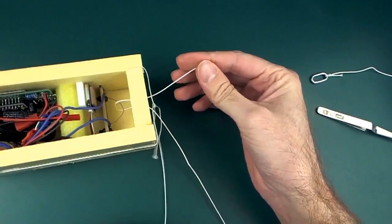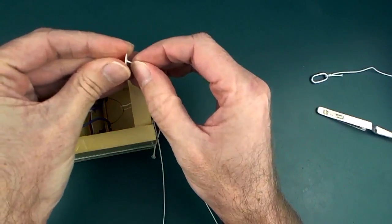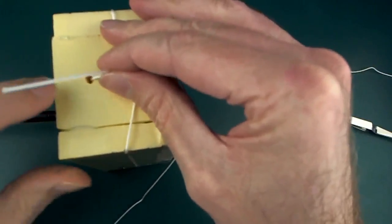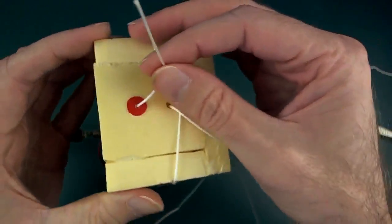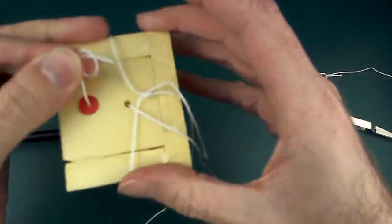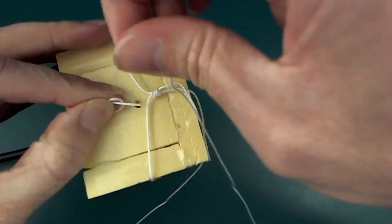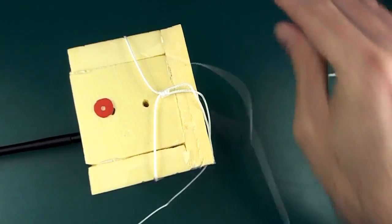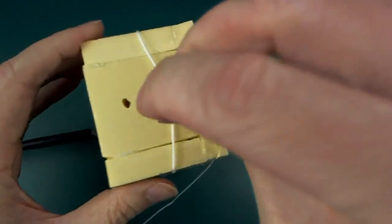And then we have a little piece of thin polystyrene sheet, high impact polystyrene that is, so it's hard. It's much harder than this polystyrene, which is the point of it, because it's going to be functioning as a sort of a washer to sit there, and then we'll just put a big old knot in this wire here like that, and then the knot won't be able to slip through the washer, so it's going to pull like that, and then when the hot wire cuts it inside, it should just slip out like that. This piece will probably fly off and disappear, so I don't think we'll be seeing that anymore.